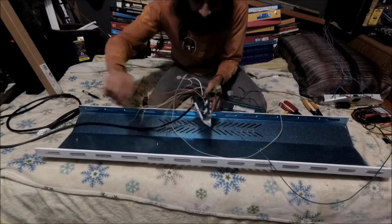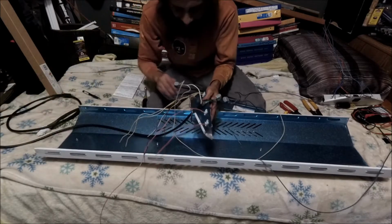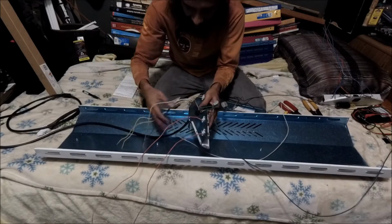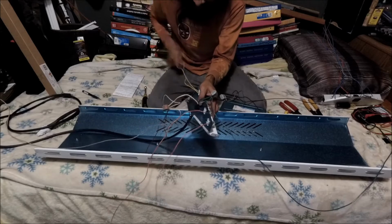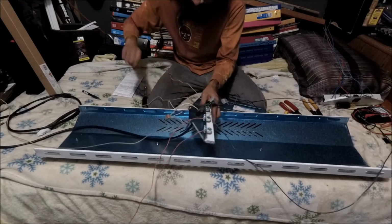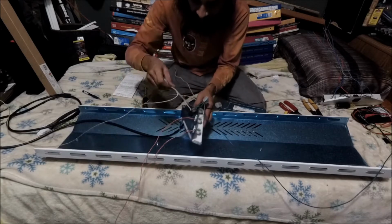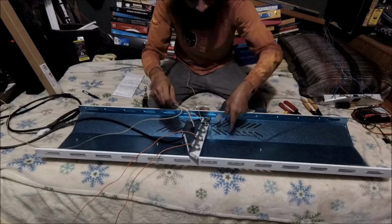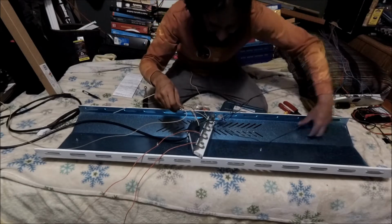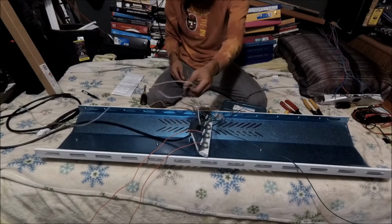And like I said, get your conductors out of the way, kind of separate them, isolate them, so you could work with ease. Alright, so we have 2 yellows, 2 browns, 2 orange. The brown is here, my hots are here. So everything's separated, right? Now we're gonna look at our neutral.